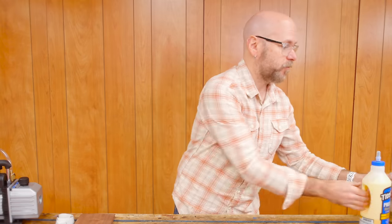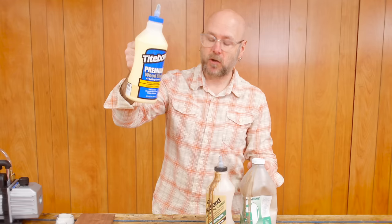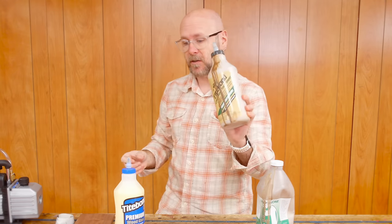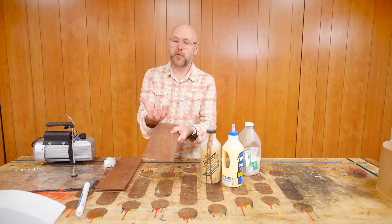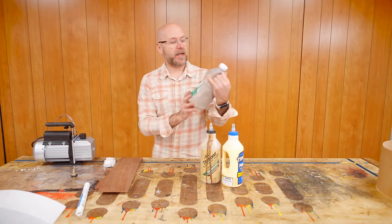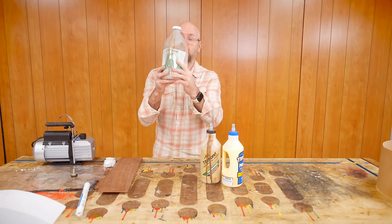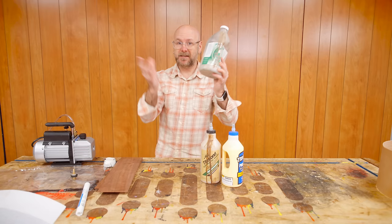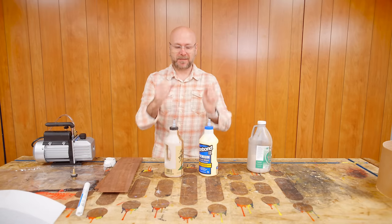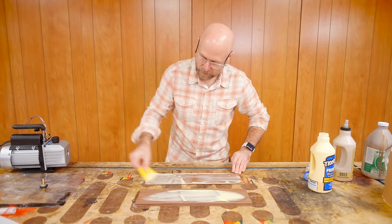And then when it comes to glue, you've got a few choices. 95% of the time, you can just use regular old wood glue. Titebond also makes this cold press for veneer glue. This glue doesn't come up through the pores on very thin veneers, ruining the top of your piece. And then I don't even know what this stuff is called because the logo is covered up now, but this stuff dries really hard and is great for crazy bends. With these two glues, when they dry, there's still a little bit of flex in there. So for this, we're just gonna use some regular wood glue.